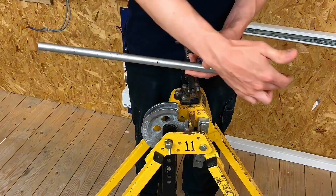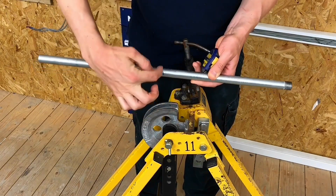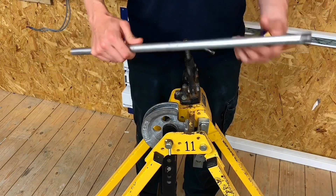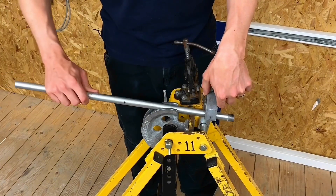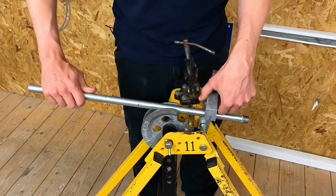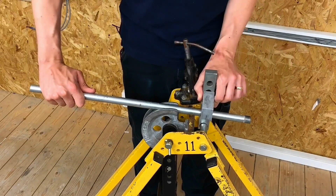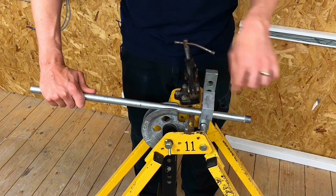What I want is, once the conduit has been bent, I want the back of this piece of tube to be level with that mark at 300 mil. So now what I've got to do is put it into the conduit bending machine in the right way. I've got my stop up and in the right position, I've got my conduit in the former, and that's ready to go.